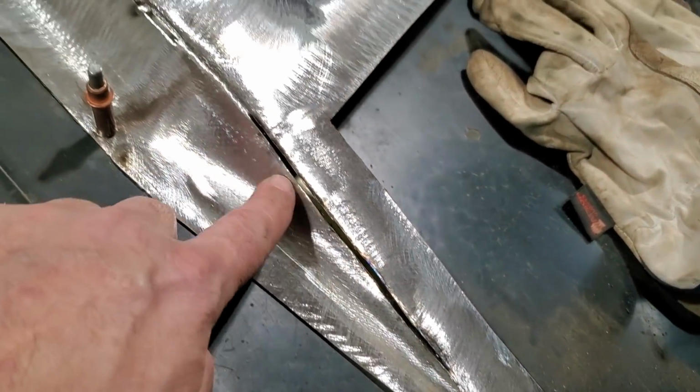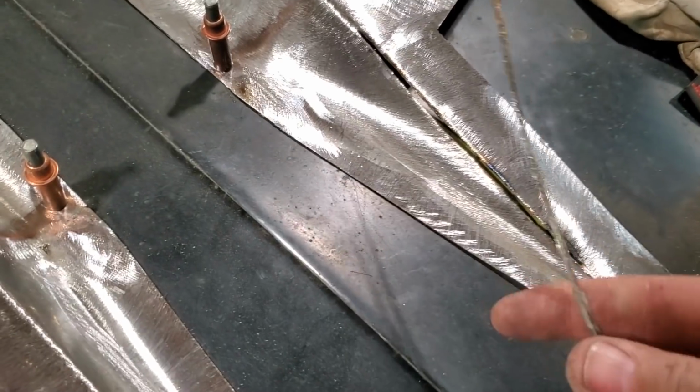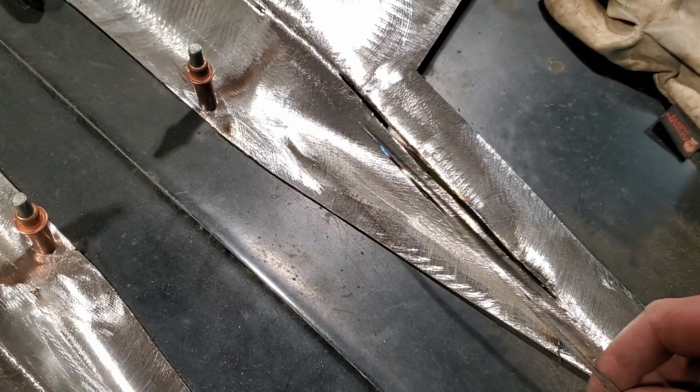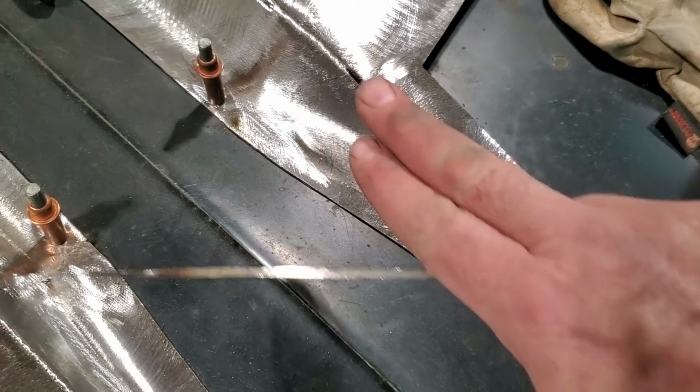You can see there now, I cut it back some more, tweaked it a bit. I put a straight edge along here and a straight edge along here to get them just right. And I found this piece of scrap that I trimmed off something earlier. And I'm just going to put that in place there now and weld that in there. And I'm going to weld it on the inside like I did before to give it strength. And I'm going to grind this off here again.